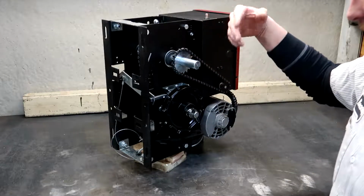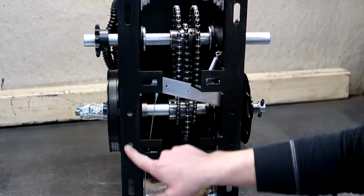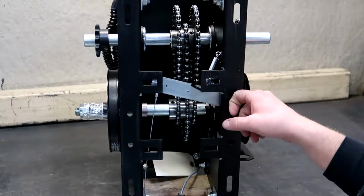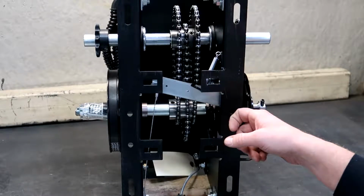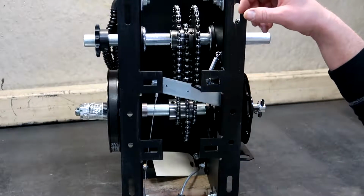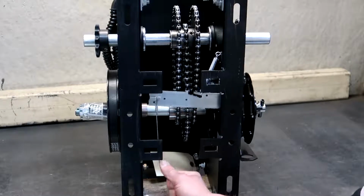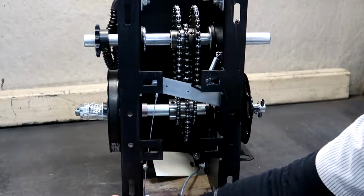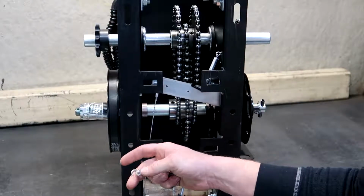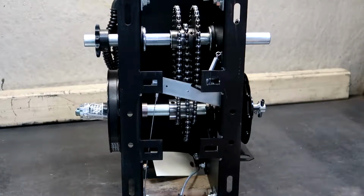So we'll turn it back and get a quick view of the back of the machine. Alright, so here we are on the back side of the Model H. Here we have our mounting flanges, whether you're mounting to a wood pad, cement, or masonry, or to an operator mounting bracket on a rolling steel door. Here we have the release to engage the manual chain hoist. Along with that, this model has a solenoid brake, so here we have an extra cable that hooks onto your chain hoist release cable, to disengage the solenoid brake so you can operate the door manually.